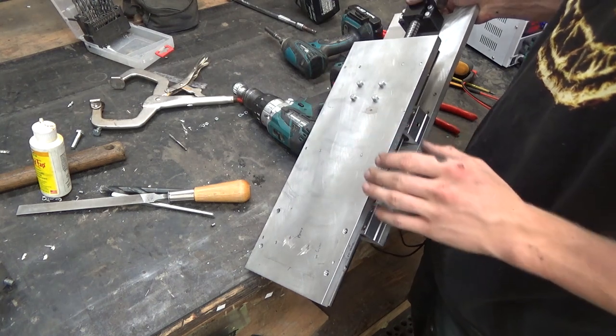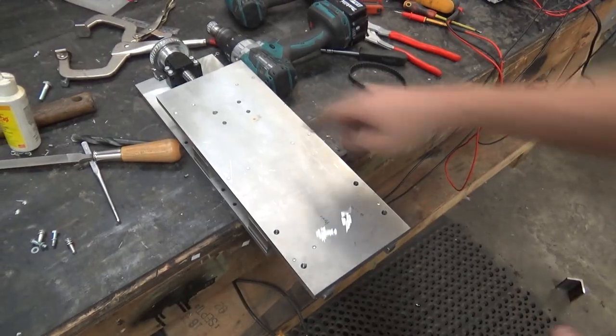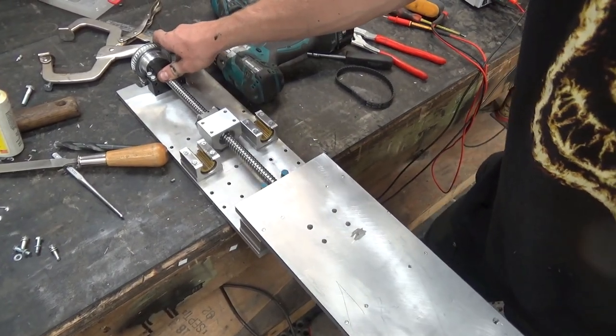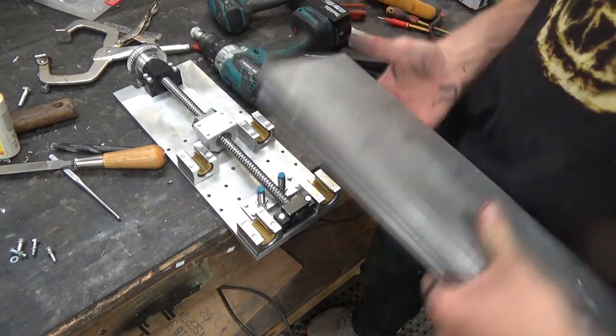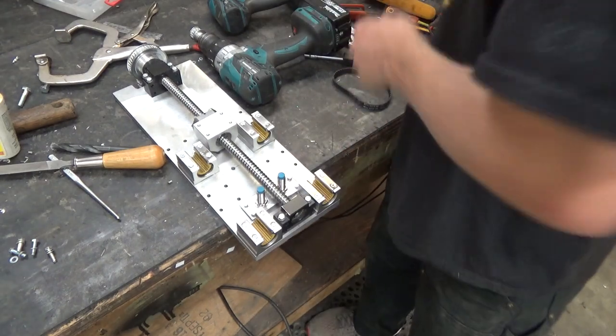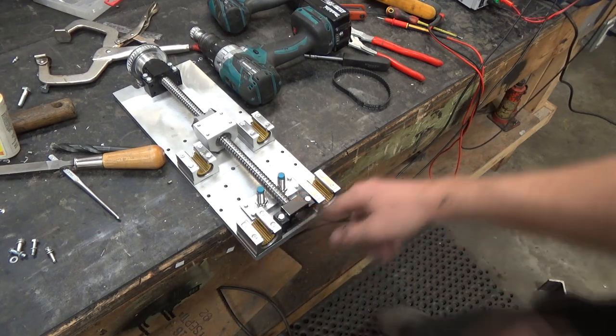I will take this off one more time just to show you how the limits are done. So right after unbolting these four bolts, you can just slide this rail off. So if you ever have to take the spindle off, you can just take the spindle off. The only other thing, you'll have your water connections on the top of the spindle, and you have your aviation plug. Other than that, these are how the two limits stick up.